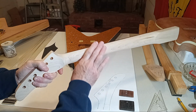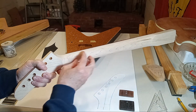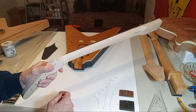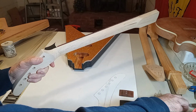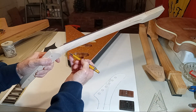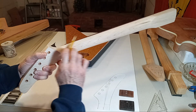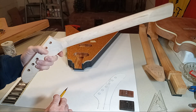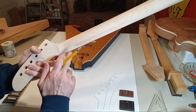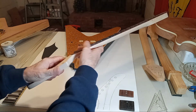And by the way, this is a plain sawn maple. I'm not going to explain what that means, but this is a flat plain sawn maple, and then they used the flat plain sawn scarf. You can see the joint when you start turning it. There's the joint right there. It's a 15 degree, and it's beautiful because the scarf joint almost disappears with the grain of the neck. So I can see it coming out right there. Beautiful. That's a phenomenal build.